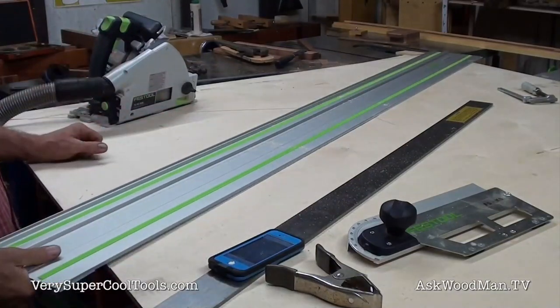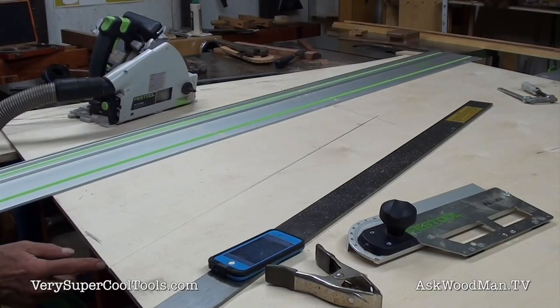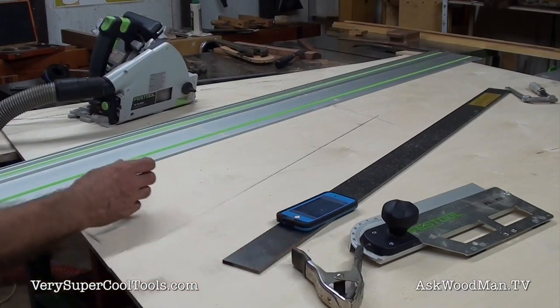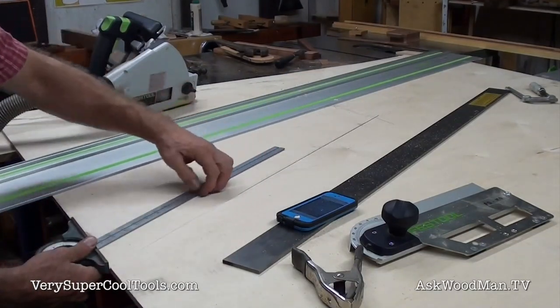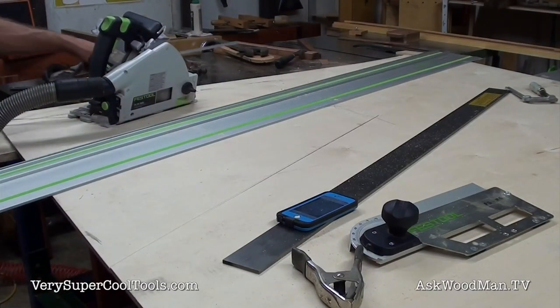The reason I have a double line is because I needed to translate my mark and shift it over — I needed the proper length from the short edge. I'm using my square here and I've got my miter set at 63.4 degrees. I'm putting it up here, sliding my square up real close, and then just marking with a pencil and cutting to that pencil line.